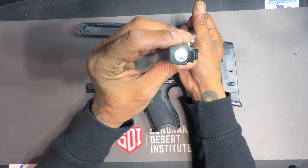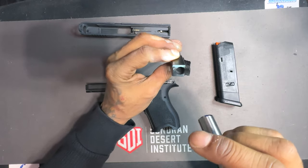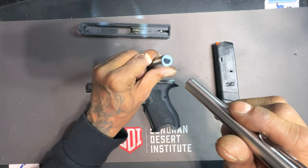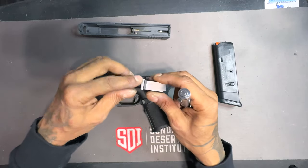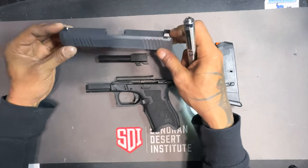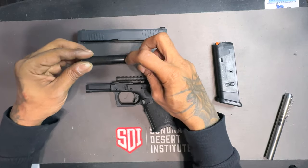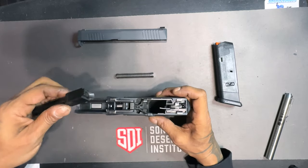You want to get a good clear look — check the barrel, check the rifling, check the cleanliness and overall condition of the barrel. You want to check the muzzle and the crown of the barrel. You also want to check the locking surfaces of the barrel, as well as the locking surfaces on the slide, which locks at the top. You also have locking lugs at the bottom of the barrel which interact with the locking block on the frame.